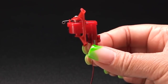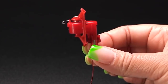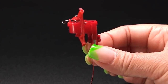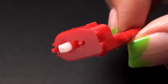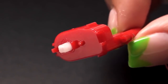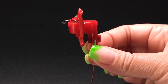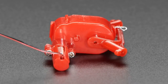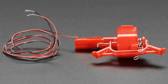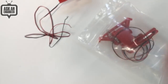They have this very unusual motor. I've seen these around — I don't know what it's for, I think it's for a toy of some sort. It's a pager-sized motor with a gear and then this triangular piece attached with a spring — it's a springback motor. You can remove the spring and it's a normal turning geared-down motor. They're rated for 3 volts. You can drive at 5, but just be careful because you have to drive it at 50% duty cycle or you could damage it. They will melt if you drive them at 5 volts continuously.